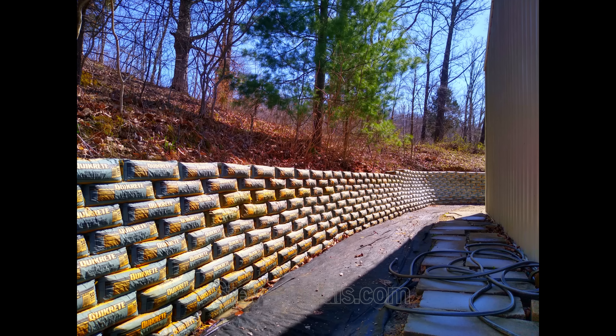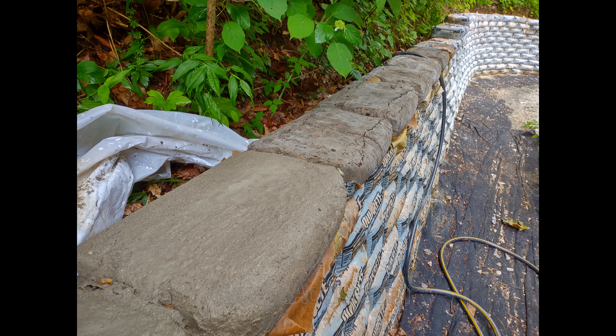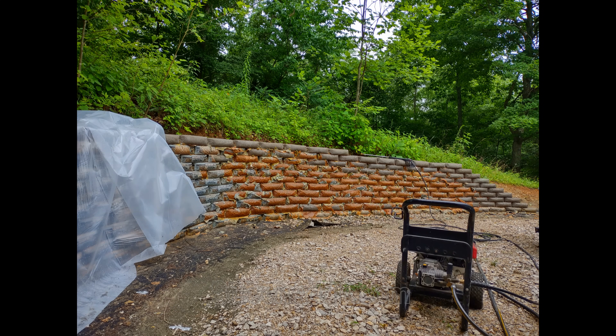The bags are going to need to be completely saturated with water, and the paper can be left on until they cure. I did find that the top bags cracked when they weren't reinforced fiber bags; however, you can fill these cracks with concrete and water, or cement and fine sand, and then coat them later. Here I am pressure washing the bags on a low setting to remove the paper. I really enjoyed this project and I hope you will enjoy yours.